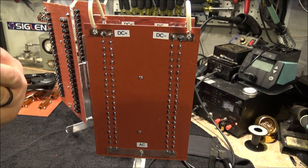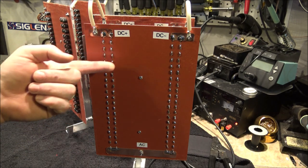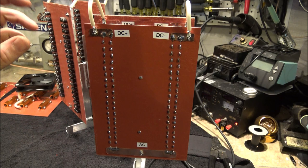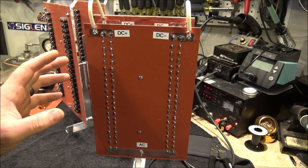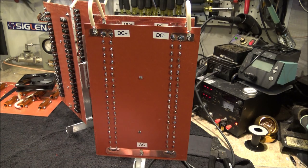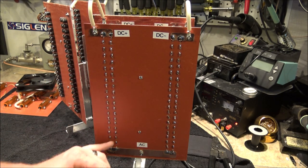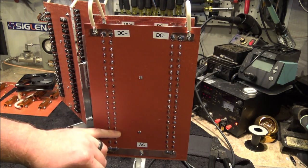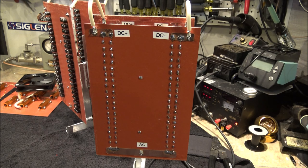Now, in theory, the way I think about it, it wouldn't matter if all the diodes are tied together. The only way that you can accurately and controllably add amperage to the circuit itself is to have each one of these strings separated out. So if you have a problem in this string, you still have this string of diodes in function. Or if you tie everything together and you have a problem in this string, it's going to thusly affect this other string of diodes. So then you can never isolate where you had the breakdown.